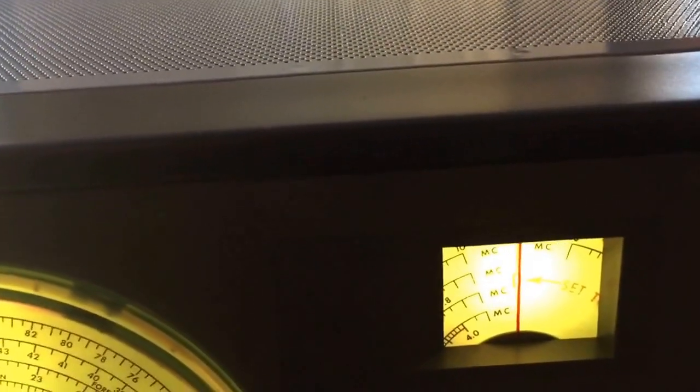Here's the fun part. We're up front watching the S meter. I'm tuned up here at about 44 megahertz, off station — I guarantee there are no stations there right now. They want us to adjust the S meter control until the pointer rests on the left-hand zero, all the way down. So now we'll go to the back of the receiver and adjust that knurled knob.